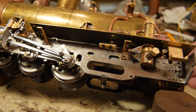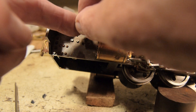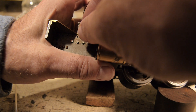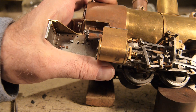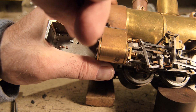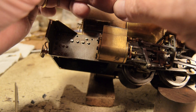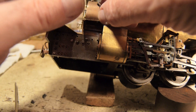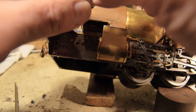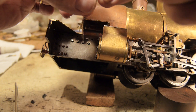Now all I have to do is come round to the front and start putting my 10BA screws in here, once I've got the smoke box right and level, to fasten the front end down. The secret is not to over-tighten these 10BA screws - they're not that strong. These ones have a so-called 11BA head on them, but I had to make a special tool because they were a funny size - not actually 11BA. So I made this tool out of a countersunk hex head screw which has been turned down, with a couple of nuts put on the back. It just happened to be the right size.